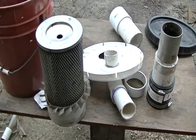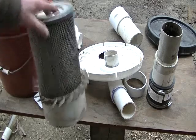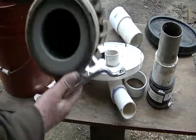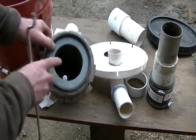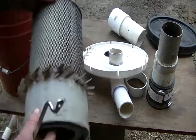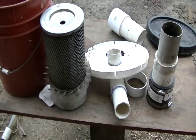So what I'm going to try to do is incorporate that into a regular old five-gallon plastic pail and see if we can't make that work. I'll show you how I went about doing it. The filter is a Wix, number 42126. It's got a hole about this big around on it — I'm guessing that's three inch — and that's the in/outtake side with the vanes there.